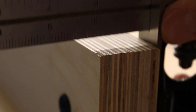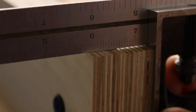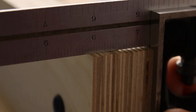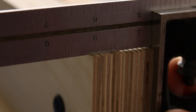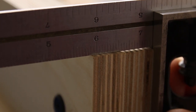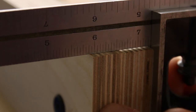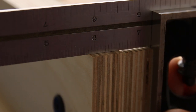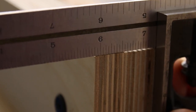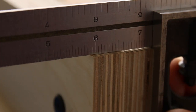Okay guys, this is the end of my crosscut sled here. So let's pretend you do the five cut method and you're out, let's say 40 thousandths of an inch on your piece of plywood, let's say it's 24 inches. So divide that by four, because when you do the five cut method, it compounds the error. So now that means you're truly out 10 thousandths of an inch. But this fence here is double the length, so it's 48 inches long. So that means now you have to adjust this here by 5 thousandths of an inch.